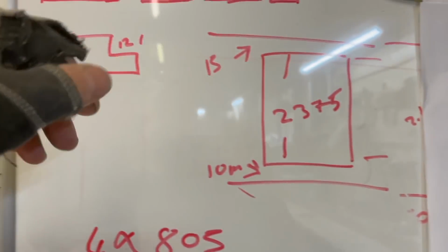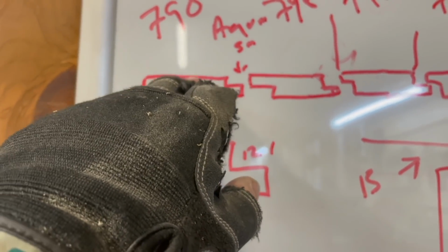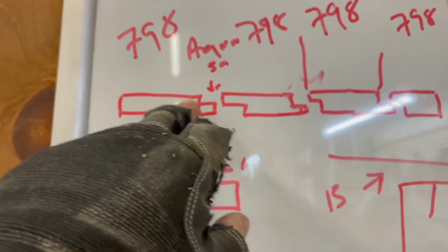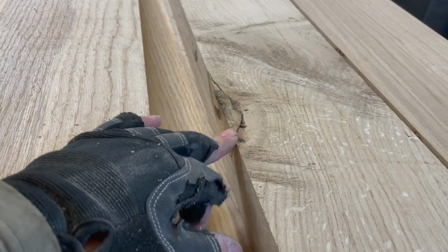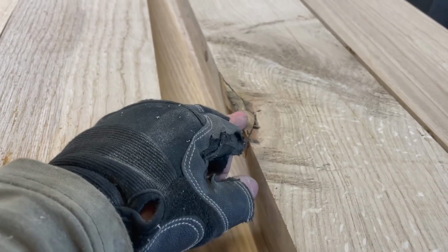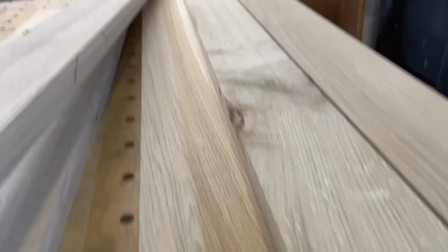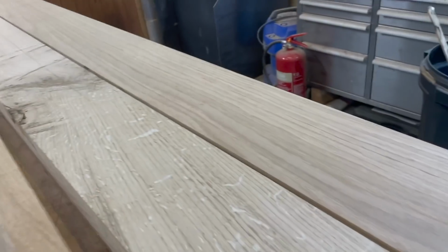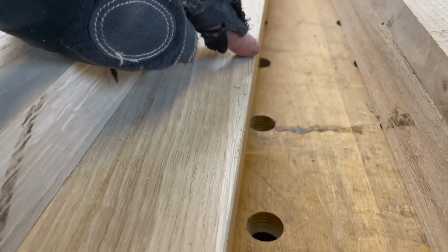So that comes off, and then just really clearly label up which doors are going to have the kind of half lap joins. So I knew there was going to be lap joints, so I need to make sure that when I cut all these, there's some woodworm and all kinds of stuff. This will definitely be removed in the join, you won't see it. And if I go under here, or when I get to it, I'll show you. I think this one here, you can see it's got a bit of woodworm in it. It's all been treated, but you know, that will get taken off.